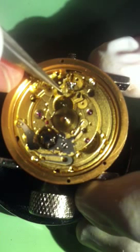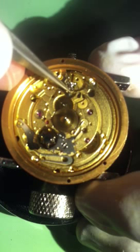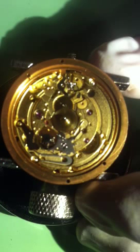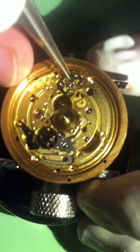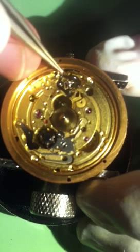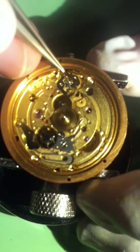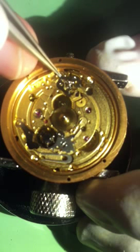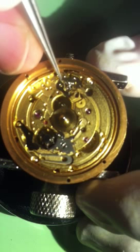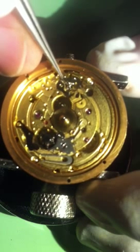We're going to go on to the levers. This little lever right here goes down in there — push it up all the way towards the center. Take this one, drop it in, and it's got a pin that sticks right down here and goes in this little slot. When we put it together we're going to push it all the way flat so it opens against this gear.